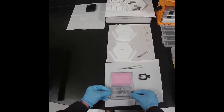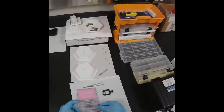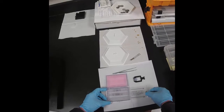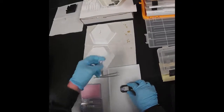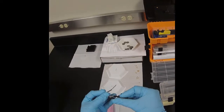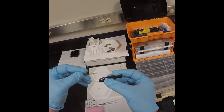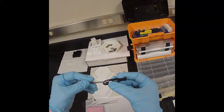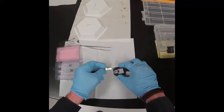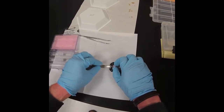Notice the sheet says to pull the sheet sideways. Especially in winter, like it is now here in central Illinois, the air is very dry, so static electricity will cause this plastic to stick together. I don't want these plastic wafers to go flying across the room, so I'm going to slide it across this way. This probe has been used, so I'm going to put it away. I'm going to use this expensive mini crowbar to get under the spring and pull up to release the chip. I don't have to use a lot of force, just enough to loosen the spring so I can slide it out.